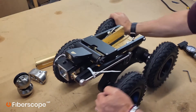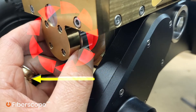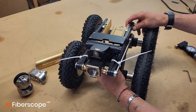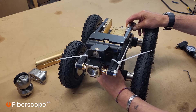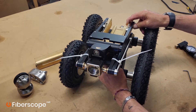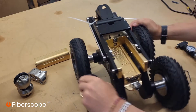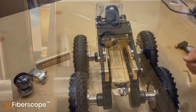Once you're in that position, turn it back round again. You need to get to the large screw underneath — the collar — and as you turn that, the elevator will move backwards. If you find a bit of resistance, just move the elevator slightly and keep going, moving the elevator now and again to make sure it goes in fully. Then tighten on that collar, turn it round, and make sure that these two connectors are aligned and there's no gap between these two parts — that means the elevator is fully backwards.